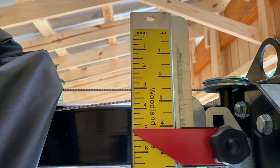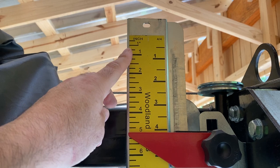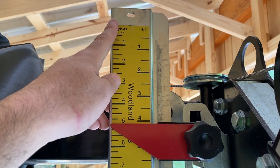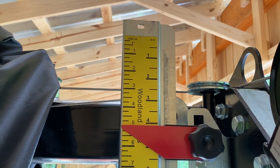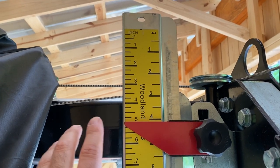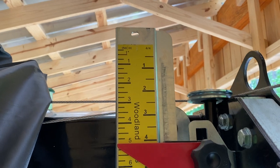What I've done is zeroed mine — you can do it by positioning the scale or the marker so that it gives me height off of the bunk. I always know where my blade is relative to the bunk. Zero means I'm sawing into the middle of the bunk, and as you go up from there you're looking at the height above the bunk. I use this most often because it's really easy to do math with — it's an absolute scale referenced to the bunk and always true to the height off the bunk.